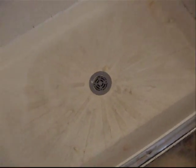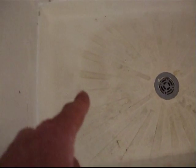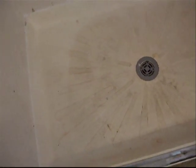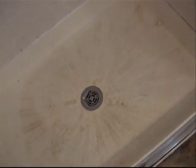They've got a fake shower pan, which is never a good idea in my opinion. The shower pans not only stain — you can tell the staining with all the dark area around here — but they do tend to crack. And when you crack one of these there's no way to fix them. So even though they're pretty easy to put in, it's a builder's grade type of thing so they don't have to pour the pan. There is some wood rot, as I was mentioning earlier from the carpet being down here for so many years and people coming in and out of the shower.